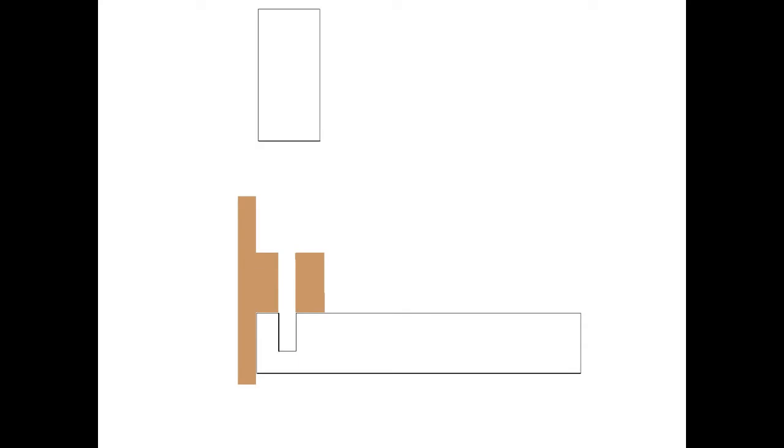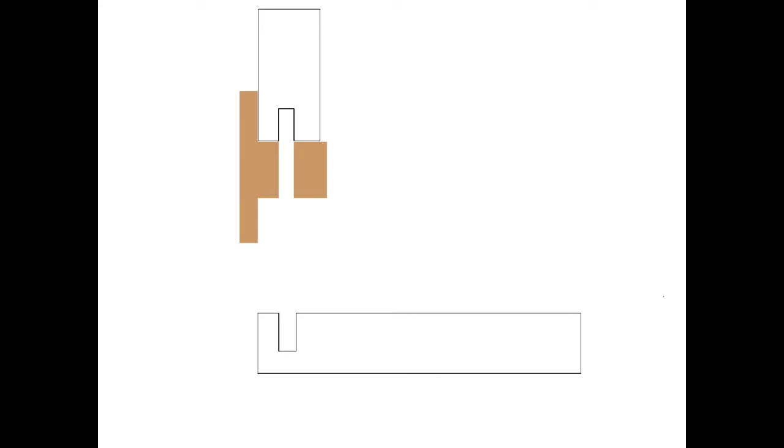After drilling one part, it translates to the other. There is only one critical dimension, meaning the jig holes need to be square, but otherwise accuracy is not critical. So, can we make a jig that meets these criteria? I believe we can. I could, of course, just machine one out of metal. Then it would be very accurate. But I really wanted to design one that could be made by anyone with a minimum amount of equipment.